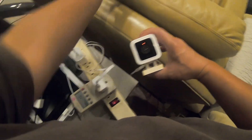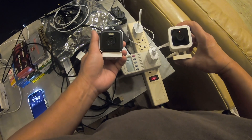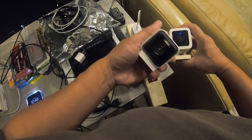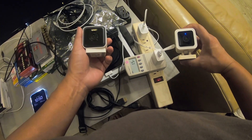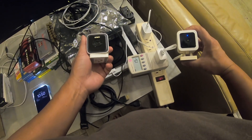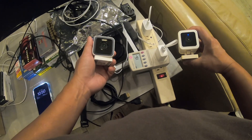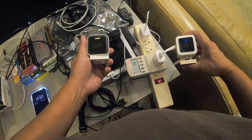I've now switched to comparing the version 3 Pro on my left and the original version 3 on my right. Surprisingly, the version 3 without Pro has lower power consumption — about 0.4 to 0.5 watts lower, roughly half a watt less. With the original version 3 fully on and recording, it's about 1.5 watts, so the older camera does have lower power consumption even without spotlight or any extra features.